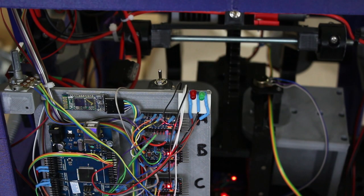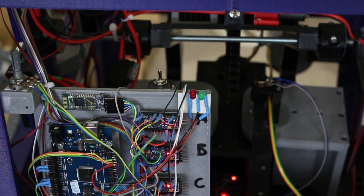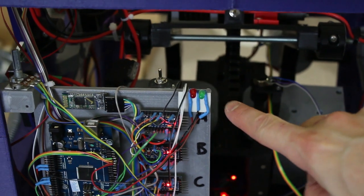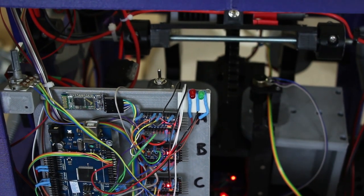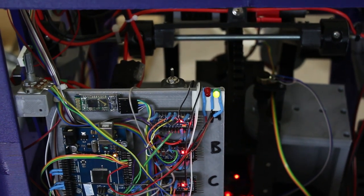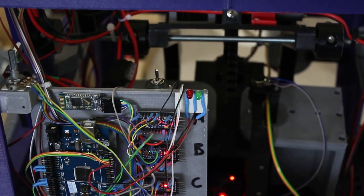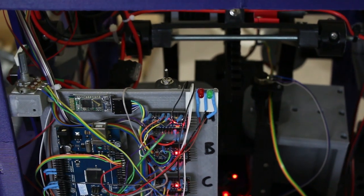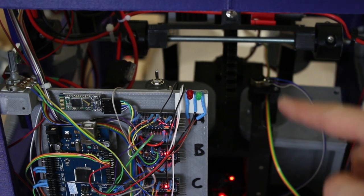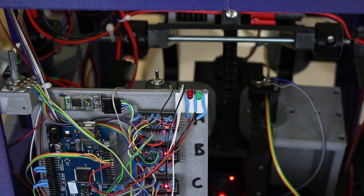I was a bit worried that if the pot came off or something went wrong, the motor would go to an end stop where it puts the legs together and I was worried about burning the motor out. So I've implemented some LEDs, a red and a green for each direction, on the same PWM pins, giving it a maximum PWM value of five volts. If those LEDs are off it means the motor's off. If I turn the legs back together, it gets stuck, and one LED stays on, I know the motor's still getting power when it shouldn't be.